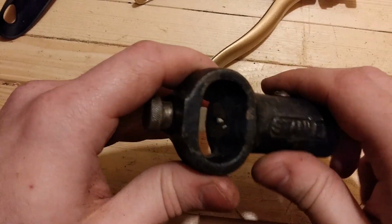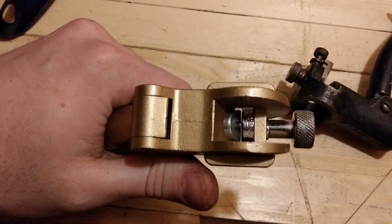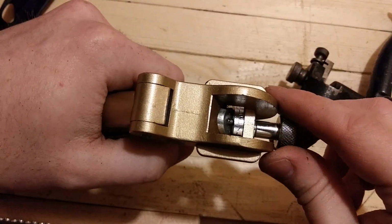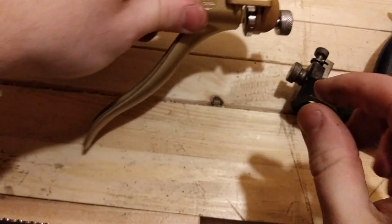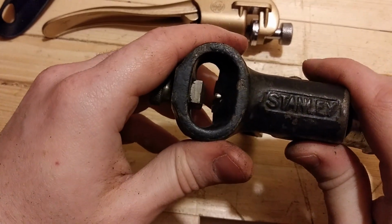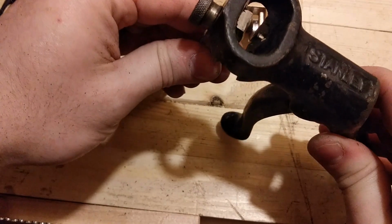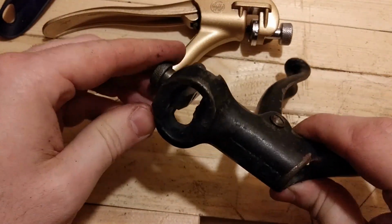Sometimes they chip. So one thing I did on this one when I got it, because it's brand new, I don't mind doing many alterations. So I took the hammer out and I beveled its edges ever so slightly on a 1000 grit sharpening stone, and those little bevels on the edges help reduce the risk of chipping. But really, that's the only thing that makes these go out of date. Other than something catastrophic, there's nothing to wear out here.